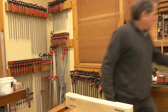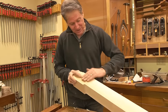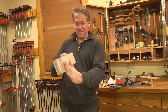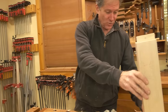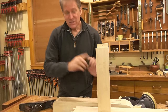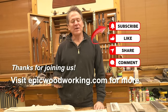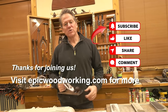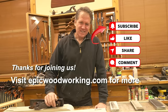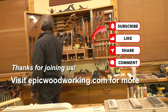It doesn't take long to just skim these surfaces. This one's already slick and glassy, so I'll just hit this mid rail — all four sides — and that'll get set in between the base pieces. Once it's glued up it would be really difficult to sand right into that edge, so this is where a hand plane comes in so handy. Remember, if you like this content please consider subscribing, liking, and sharing, and head on over to epicwoodworking.com. Good night, everyone — see you next week!